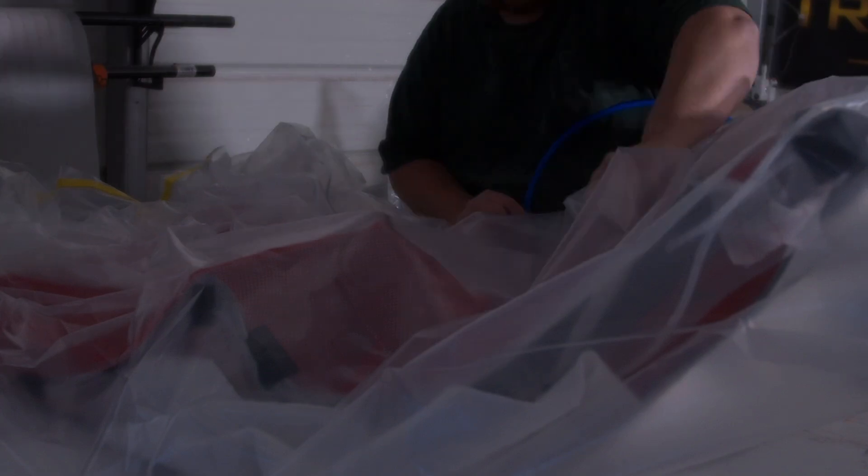I made some infusion fittings with the 3D printers as well. They worked really, really well for this application. I just put them in the bag and then poked a hole and stuck the quarter inch vacuum line into them. It worked really well.